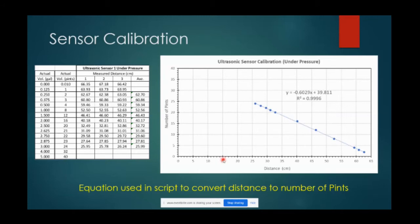Next I had to calibrate the distance - the distance measured gives you the relative height of the beer level, and I had to translate that into number of pints. I put about three gallons of water in each keg, pressurized it, dispensed some liquid out, and measured the distance at different volumes. I took three measurements at each volume. Since the kegs are essentially cylindrical, it fit a straight line pretty well, which simplified things. The linear equation I generated from the data I use in the programming to convert distance to number of pints left.